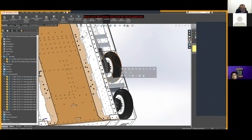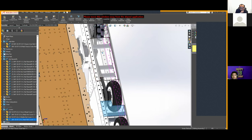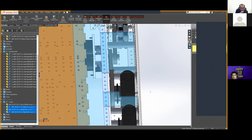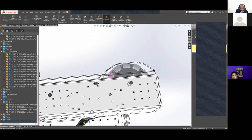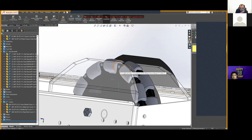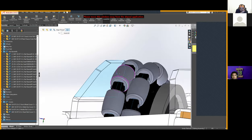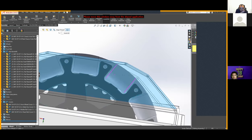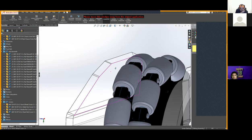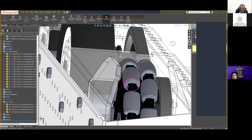Late in the season, we added wheel guards to try and protect from balls coming in, because we realized that was a problem, probably week 6. After our first event, we realized that Omni wheels were not a good plan, but we were stuck with them. So to solve our Omni wheel issues, we tried to add these Lexan shields to protect them from the sides and the front when we go over the berm. They were never actually tested on a field, only in the lab. We still broke the wheels on the first version, but this is the second version that was never tested, so who knows how they work.